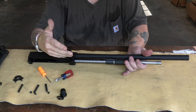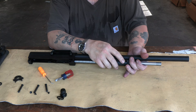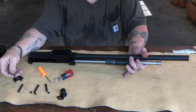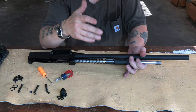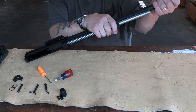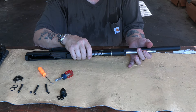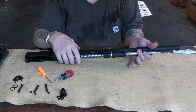After several failed attempts, I took this, put it back in the lathe. It was the second set of threads — when the plug is in there, the lines of the barrel a certain way was catching on the washers. I had to file it in a weird way, backwards, and all that. What would happen is somewhere in there it would catch that washer and lock the barrel in place and I couldn't go down and I couldn't pull it off. I got it down, checked it, got it together, and it's just something I'll keep an eye on.